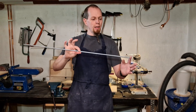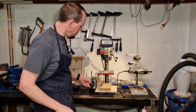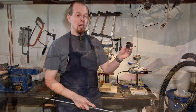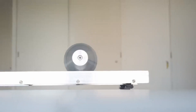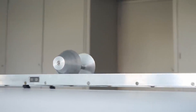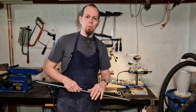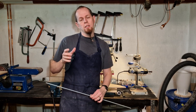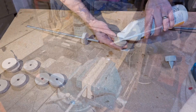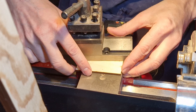For the wheels I'm going to use this rod, and I'm going to mount the wheels on it using this hole saw. I'm going to cut pieces of 12 millimeter wood and then turn them to be a cone shape. This will make the big wheel center very nicely when it's running — it works on the same principle as train wheels that slope. I'll talk about the math of how the slopes were designed in a later video. But first I need to make this, so I'll cut the rod, cut the wheels, and turn them on the lathe to get them conical shaped.